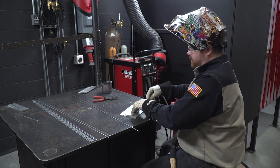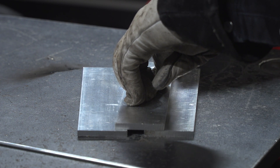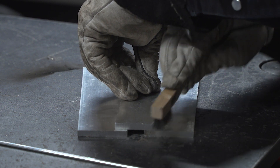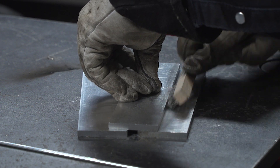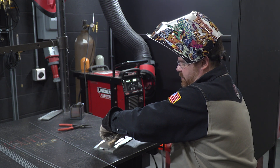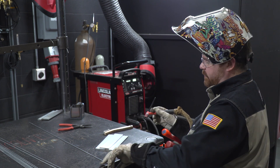I'm going to do a mechanical cleaning of the oxides. There are surface oxides that can be removed with a stainless steel brush, and you don't want to contaminate this brush with any other metals. If you're welding stainless steel or mild steel and using a brush to clean them, don't use that same brush on aluminum or any other material. Each brush needs to be dedicated to what you're using it for.